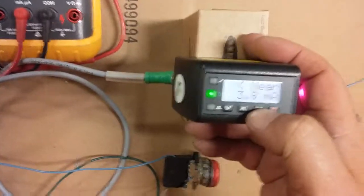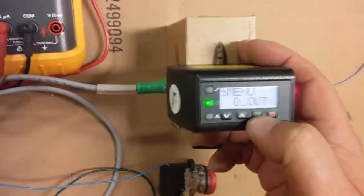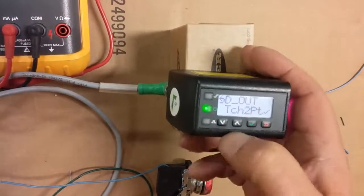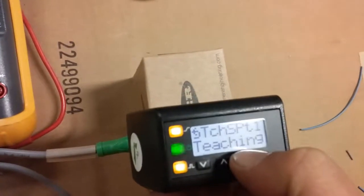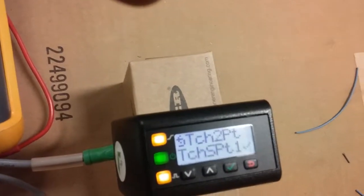I'm going to put my chair at this tape mark on the floor. I'm going to come up here and program this into digital output teach two-point. I want to teach point one — it's going to be hard to do while holding the camera. I've got my target lit up, I'm going to push teach one — teaching point one.